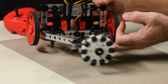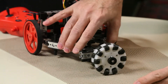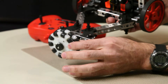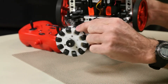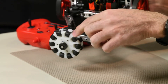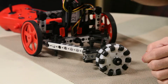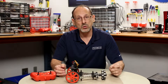The advantage of an omni wheel at the pivot on the back is that it rolls not only forward and back but also sideways on the rollers. One unique characteristic I want to point out is that I've actually put two omni wheels together, alternating the spacing of the rollers. This evens out the circle — using just one would create a flat spot between rollers, but doubling them up and alternating compensates for that, giving a smooth rolling motion in both directions.